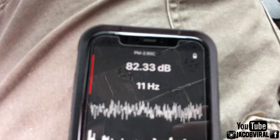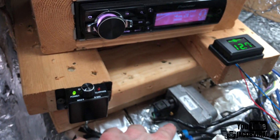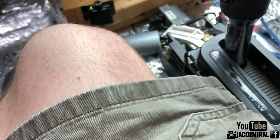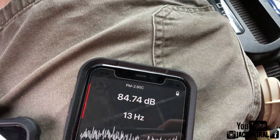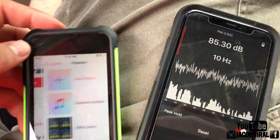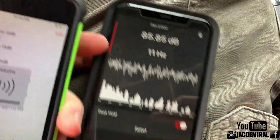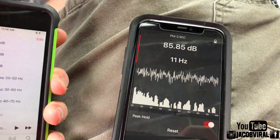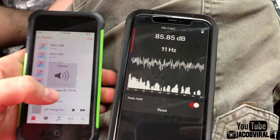I'm going to have the meter on. Like I do in previous videos, I always do around volume 20, with the bass knob all the way up. We'll find out what it peaks at right now and I'll take pictures as I go. For test tones — people ask where to get them — I bought a USB from a DJ on Facebook that had them, but you can also get sine sweeps from a lot of sites, just Google it. I'm going to use a sine sweep starting at 40 hertz. Here we go — port adjustment.